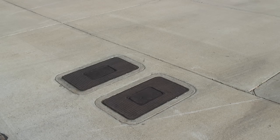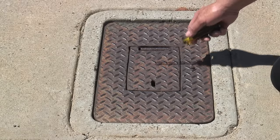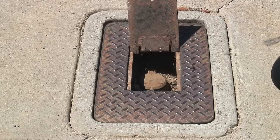The first obvious step: locate the water meter. You'll find it on your property near the street in a concrete box with a concrete or metal lid. In the lid, there's a small slot to facilitate opening. A screwdriver will work well in removing the cover.